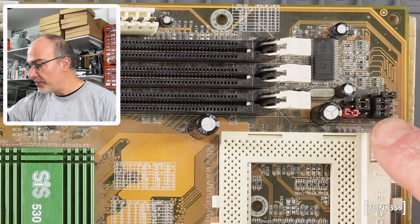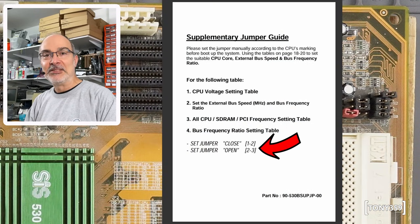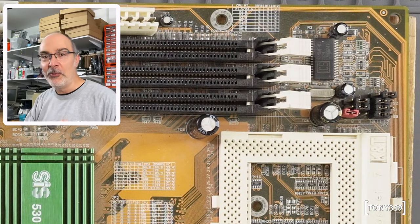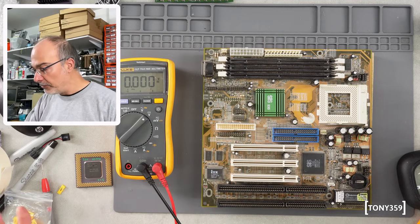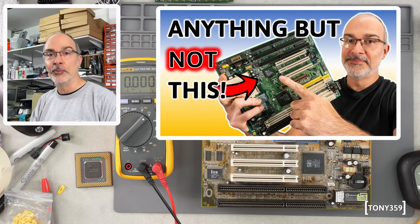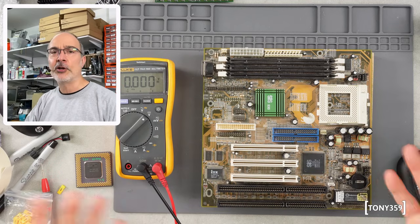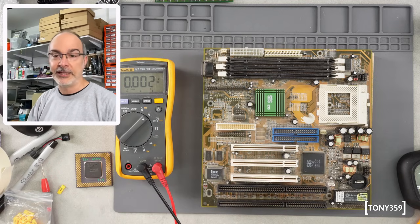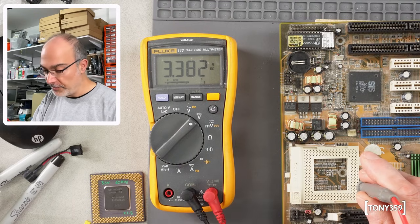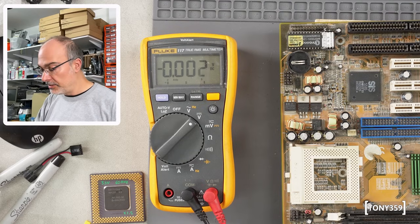One quirkiness I think is specific to this board: when it says 'closed' it means pins 1-2, and when it says 'open' it means pins 2-3. I never heard about that — if it's open and closed, it means open and closed; if it's 1-2, it's 1-2. Anyway, it took me a while. As before, let's power this up without a CPU first to check the voltages, because in a previous video I found a board with a faulty VRM outputting 5 volts on the CPU V-core. We got 3.3 volts and on the other side 3.5, which I think is totally fine.